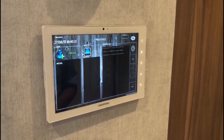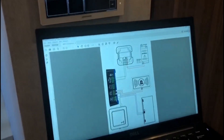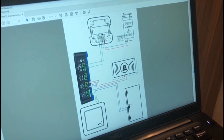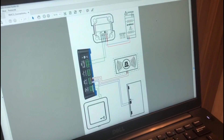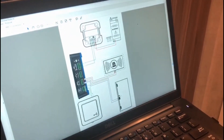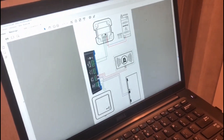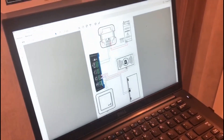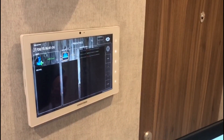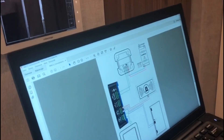In terms of wiring, what we basically did was link the finger scanner directly into a Crestron controller through an RS-485 interface. We are using the relay contacts of the Crestron controller in order to unlock a front door or, for instance, arm or disarm an intrusion alarm system. At the end of the day, it's a simple relay contact, so we can literally wire it up with anything working on electricity and control it through the unique fingerprint.